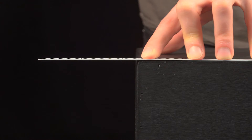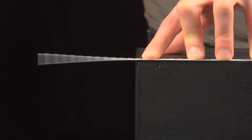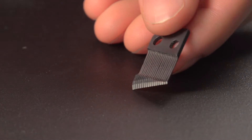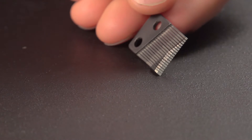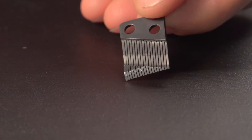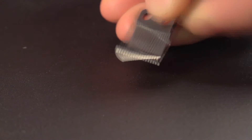The teeth are like this saw blade. When it's longer, it produces a lower note when plucked, and when shorter, it produces a higher note. Notice when you turn the comb over, the teeth don't have the same thickness. The longer teeth, the lower notes, are weighted more on the ends. This added weight lowers their resonant frequency even farther.